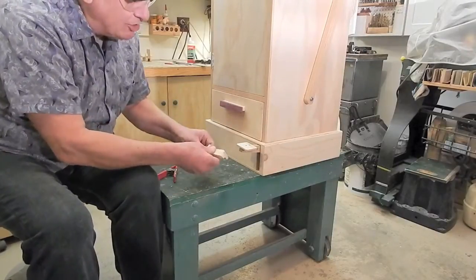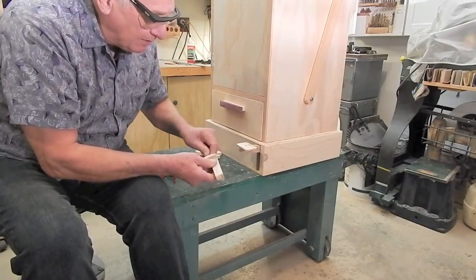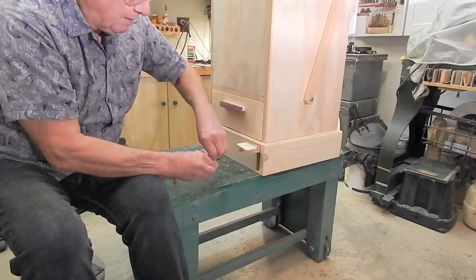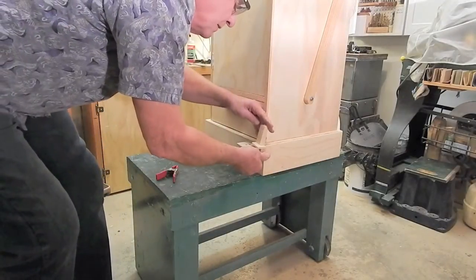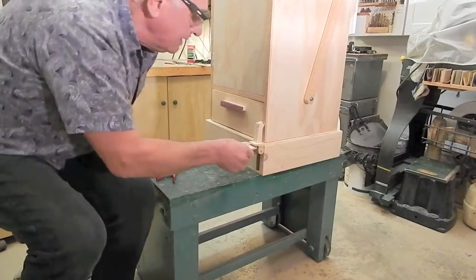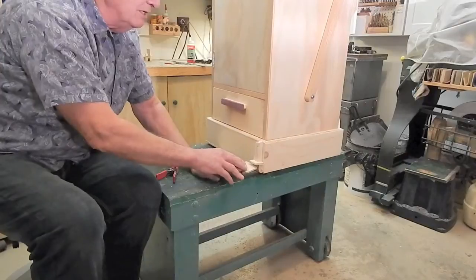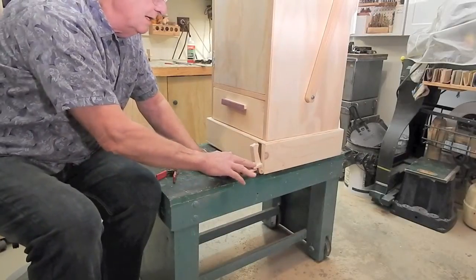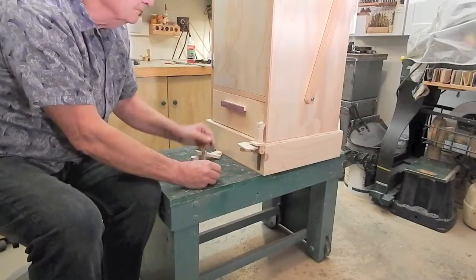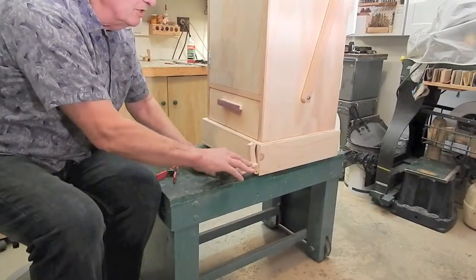Here's my prototype latch, and there's one more piece. At the very bottom is a small round head screw, and I've attached a tension spring to it. The tension spring connects to a little round head screw near the tip of the caster arm. And the little tension spring pops the latch into the slot when the pedal is depressed. And with the little toe pedal, you can extract the pawl from the slot and allow the casters to retract. And of course, that's the drawer open regardless of what position the latch is in.